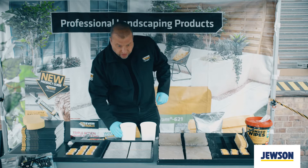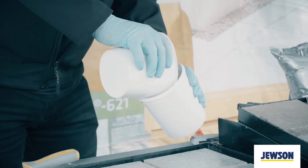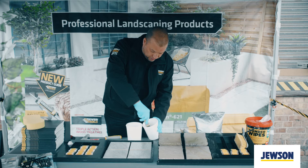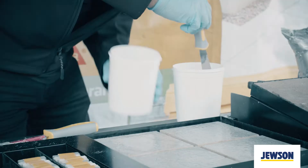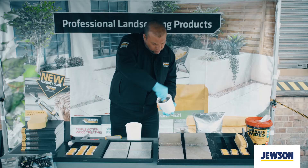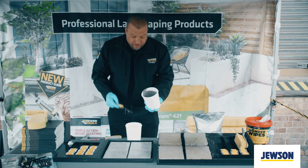So with the flow fix, obviously it's powder always into water. Normally you'll mix it in a bucket with a spiral mixer or a paddle mixer — obviously we're doing a smaller demo today. Your water level mix is around 16% water. You can add a little bit more if you need it to slurry. Mix for two or three minutes normally until you get that kind of pourable consistency.